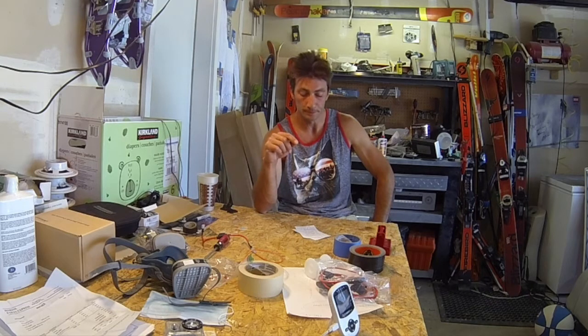On the driver side of the boat I have a bit of an issue — I thought I was going to gelcoat it for the final coat, but I used the epoxy base fairing compound on it, so I needed to switch to paint. I've primered it and now I actually have to do the painting of the floor. I'm going to pull up the masking from the deck paint job and then remask for the floor painting.